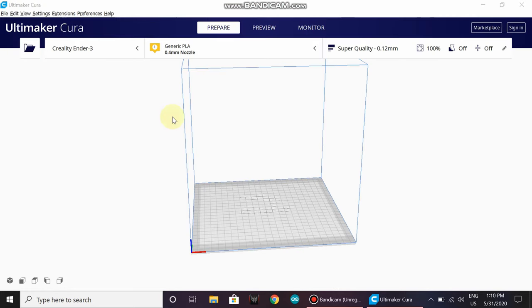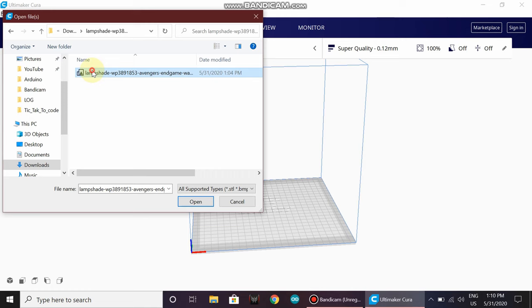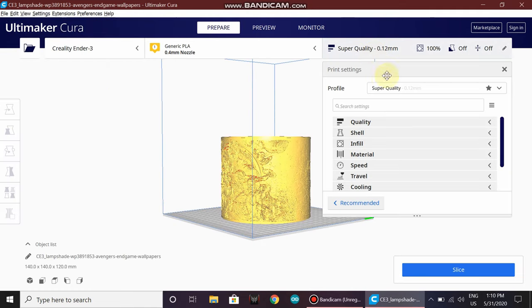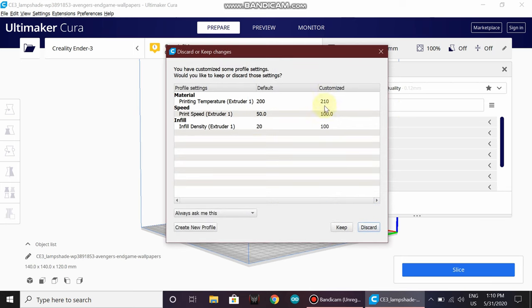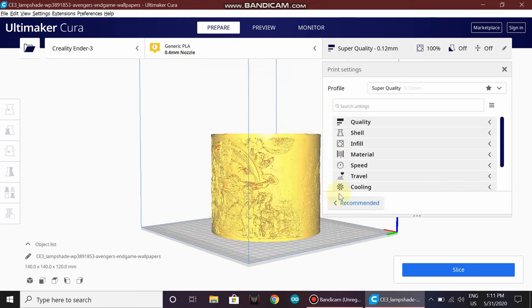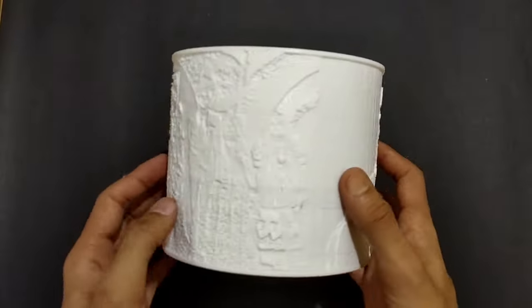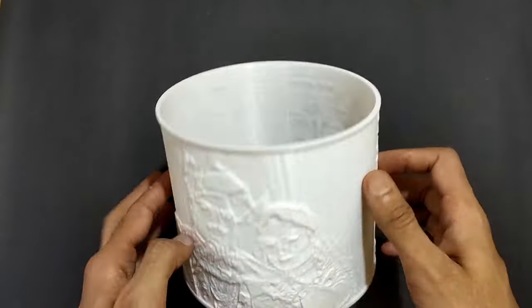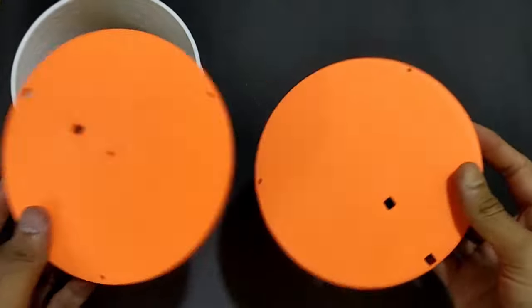Open the slicing software, in that open the lithophane STL file. Set the quality of print to super quality, temperature to 210, print speed to 100 and infill to 100. The remaining 3D prints you can print in standard quality. All the STL files that are required in this project are given in the description below.